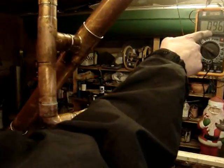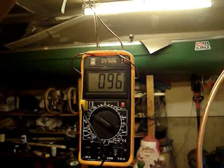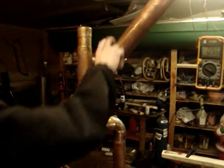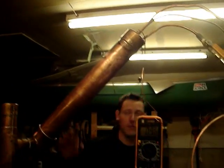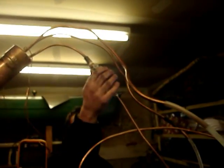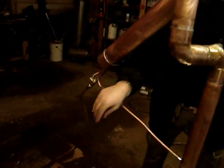You can see that the water is boiling at about 96 degrees Celsius. Not all thermometers are exact, so kind of do the math on that. It's boiling right now. As the vapor comes across here, I have a condenser. Up here I got a little valve — just a pressure relief valve. Once my temperature goes to 78 degrees Celsius, I'm going to close that and close this valve here and open this one.